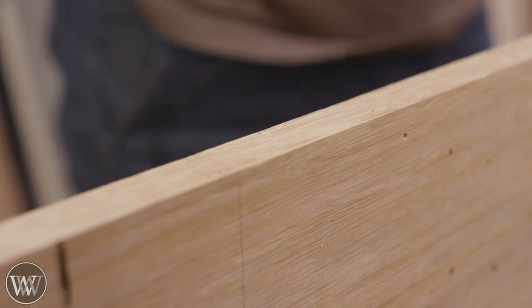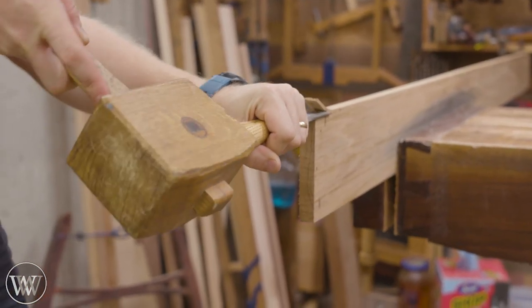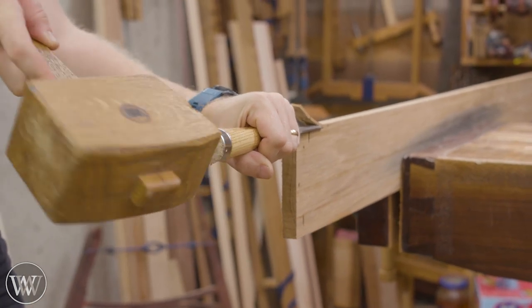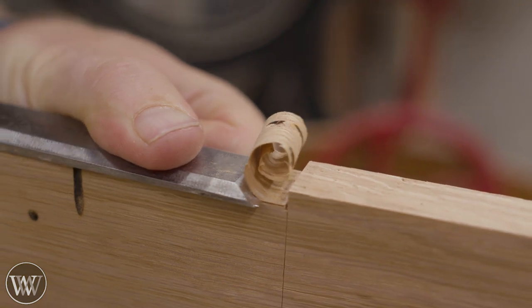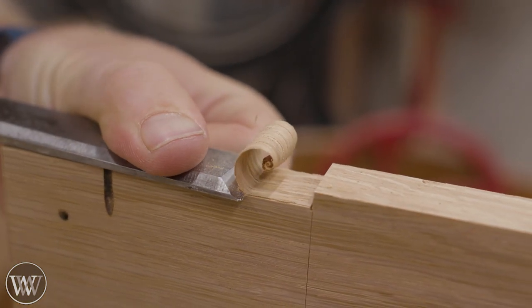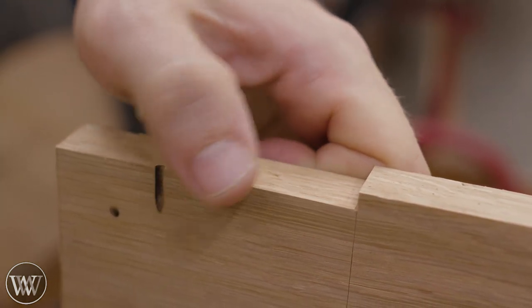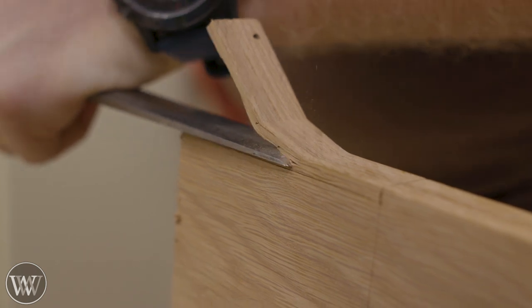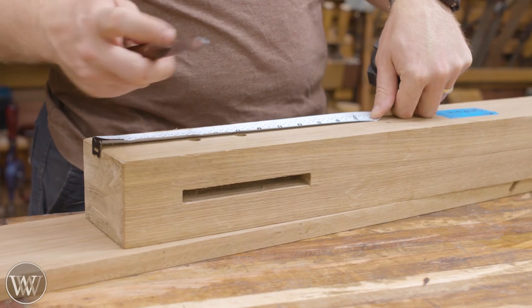I really found this enjoyable — just popping off these extra pieces. Anytime I get to take off large chunks with a chisel, it's very enjoyable. But then you also get to come back and do this fine finesse work, and these curls are just a pleasure to take off. Here you can see one that's going perfectly straight grain and I was able to take off a lot — it's been very easy. Nice smooth surface and a very happy tenon.